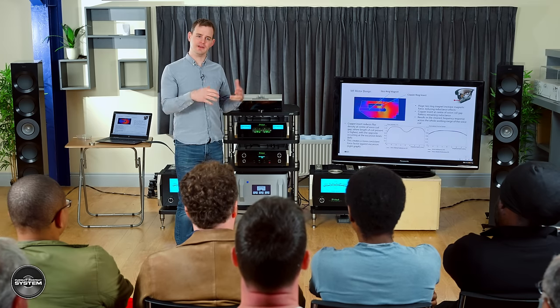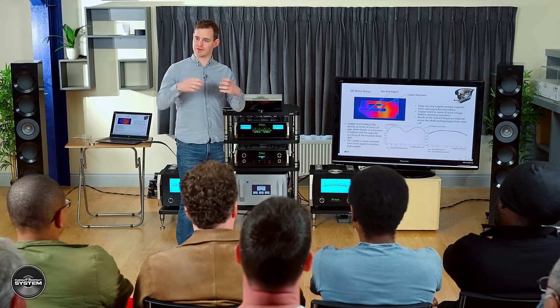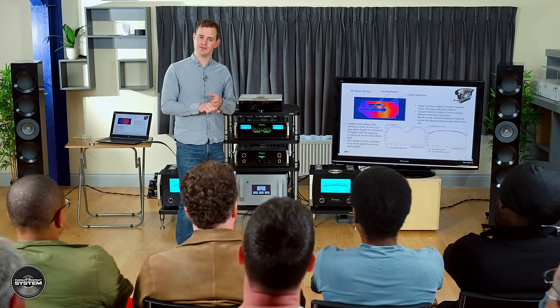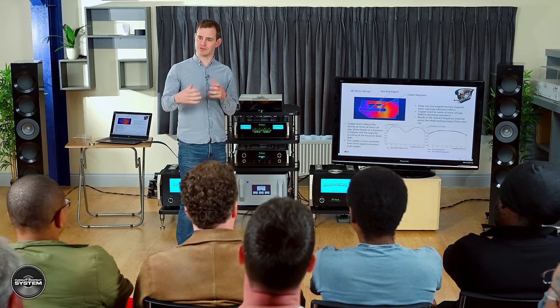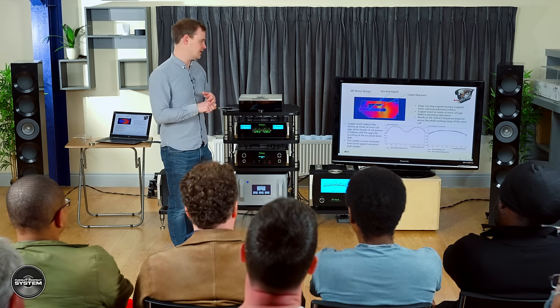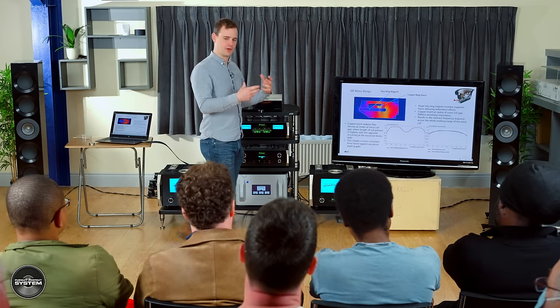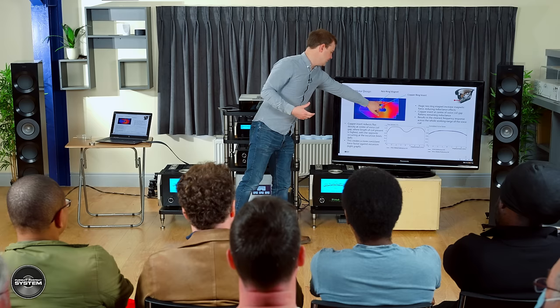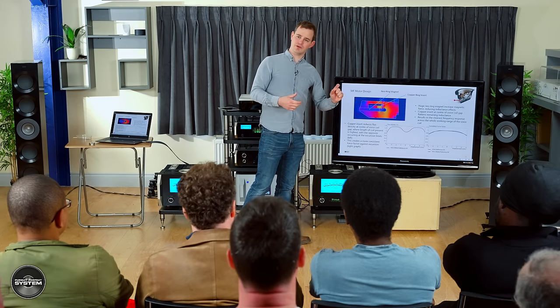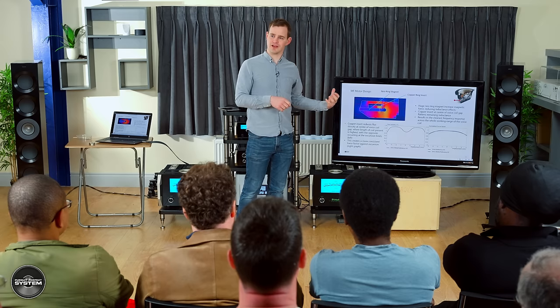The next part of it is to make sure that when the coil's moved, so say you're playing music, the coil's going to be moving constantly, so that we don't get any change in how strong the motor is when the coil's in different places. And that's a fairly tricky area. So what you have to come up with is an arrangement where, you see here's the coil in here, that when the coil moves, the amount of strength the motor has is constant.